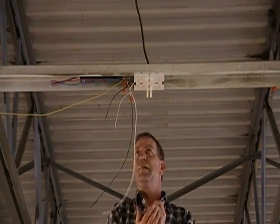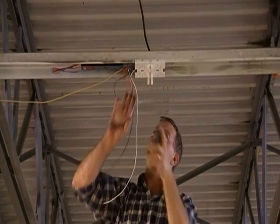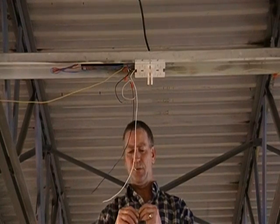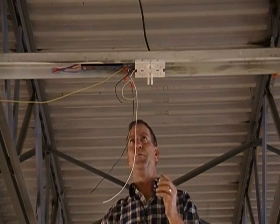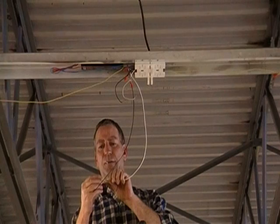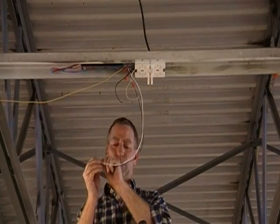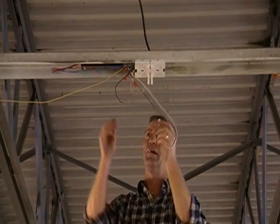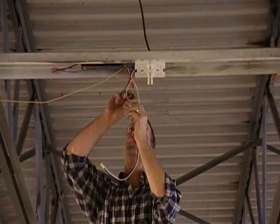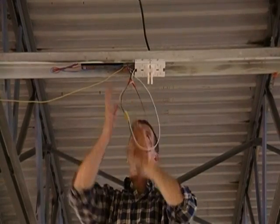You'll need to connect the black and white power feeds. There is a recommended ballast disconnect for any voltages greater than 347. In those cases, where voltage is higher than 150 volts to ground, you need a CSA-certified and recommended ballast disconnect. They're color-coded for black and white so there's no confusion. Make sure you put the black wire under the black quick-connection point and the white under the white, then attach your disconnect together.